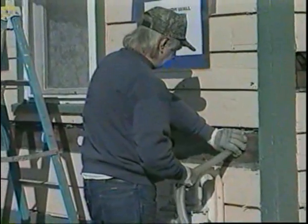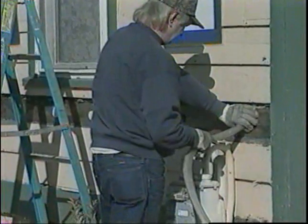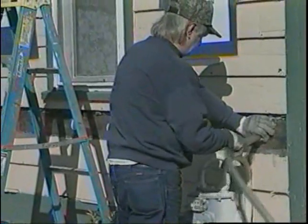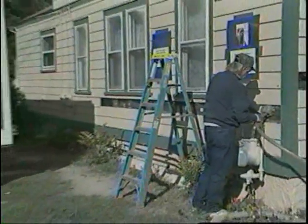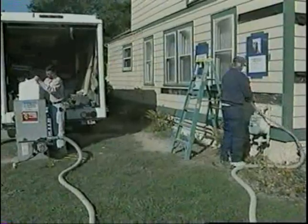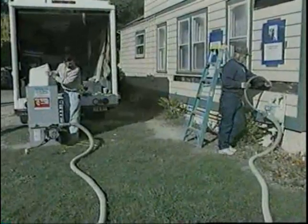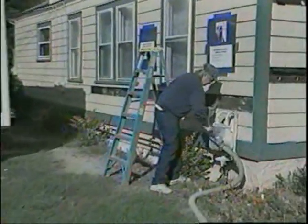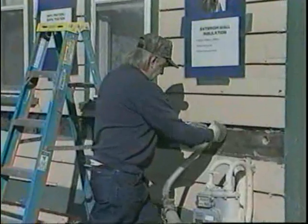After I'm done, some of you may want to just poke your finger in the wall and use the holes — you can see how densely packed that insulation is. Now once you've gone ahead and drilled your holes, the next step is the actual insulating of the walls. To do this you use a special nozzle, which you insert into your holes. The special nozzle is connected to a hose which leads to an insulation hopper, and basically you have a person pouring insulation into the hopper and blowing it into the walls.